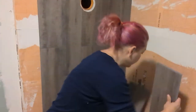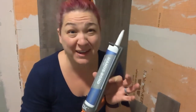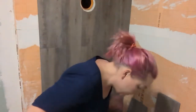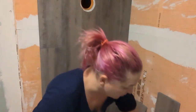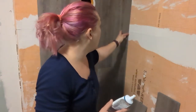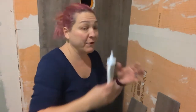Your wall planks are attached to the wall using adhesive, which you will get in your kit if you buy the shower kit or the bathroom kit. You also get silicone caulk. This caulk goes between each layer — when you are putting in your next column of tiles, you put your caulk along this line here to help keep water from seeping through behind your tiles. You also do it along each seam, so every seam you put this on the back. You put your adhesive that sticks to your wall, and you should have some sort of waterproof board behind it — this is Schluter, but you could use a number of other options.